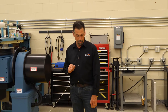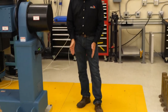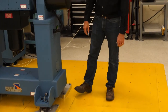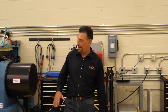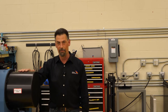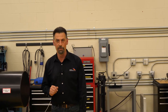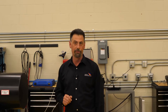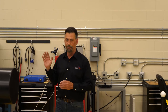Here at Ideal, and with a lot of our customers, we are very fortunate to have an encased isolation pier. In this case, the pier is two inches of stainless steel on top of two feet of concrete on top of pilings. That isolates us from external surrounding areas and gives me the ability to work in the sub-arc-second range. We have a very stable system, so the numbers we get will be very stable.